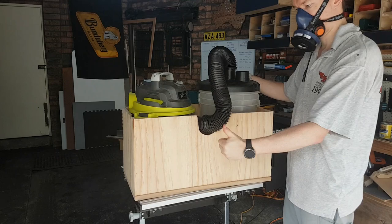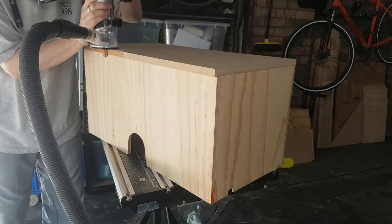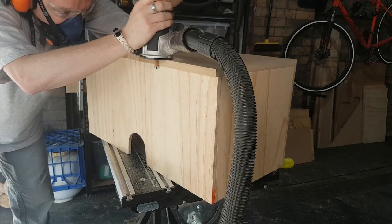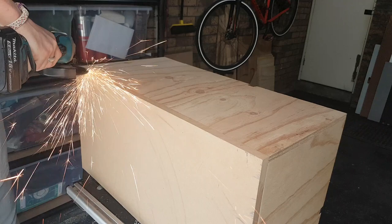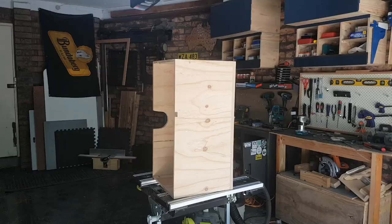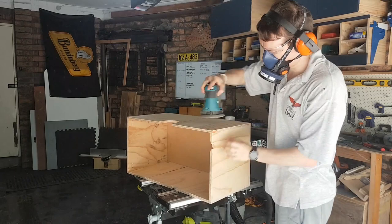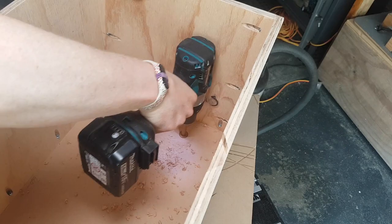I had cut that base a little bit proud as I usually like to do so I can come around and flush trim. But because I knew I had those protruding screws too far out, I removed four of the five of them for this shot, and skipped the bit in the middle where the last screw was so I could not destroy my expensive router bits. Flush trimming that down — once I was done I could re-put the screws in. Then I've just got the sanding disc on the angle grinder, hiding my mistake by trimming off those screw ends. Everything is fixable. One last quick buzz with the sander to get rid of all the sharp edges and corners.